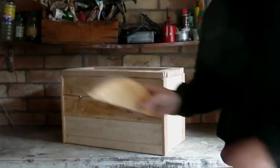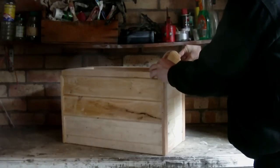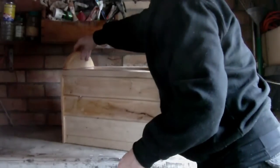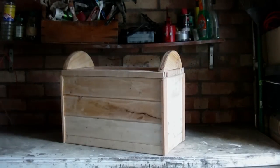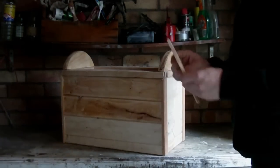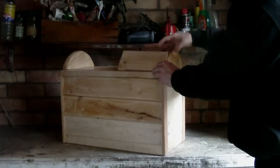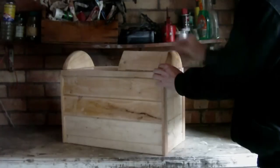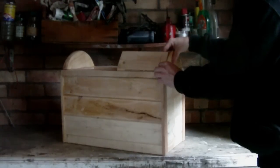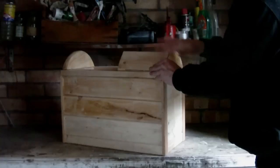Then, that seat on the end, actually, I'll do the flat edge out. I've sanded, cut and sanded these back, and what I've done, that's the right way, what I've done is either, this bit of scrap will do, but you can see the shape of the lid, and then what I'll do is I'll figure out, you can see overlaps ever so slightly, it's a 45 degree angle cut on there, which I can do on the flat stuff. Basically, it overhangs, then I'll sand it back, and it'll produce a nice little curve.